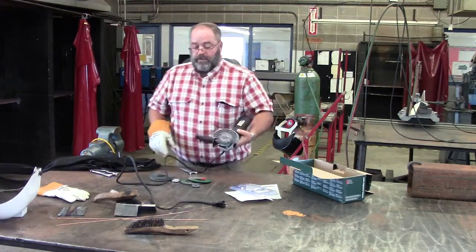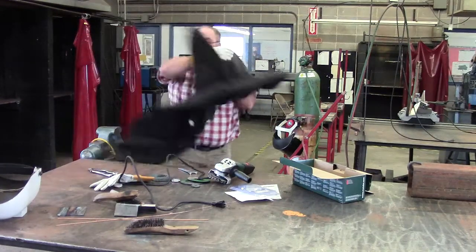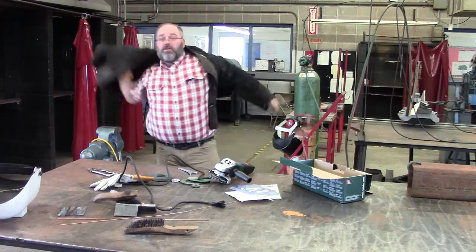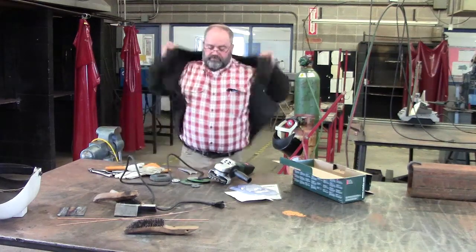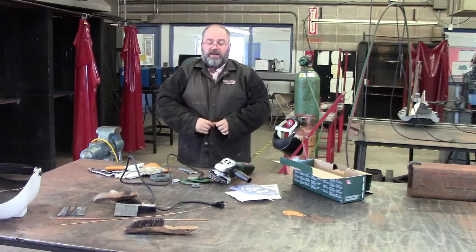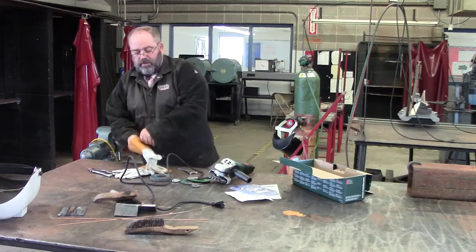Okay? So anytime you get ready to use a grinder, you need to have at least your long sleeve shirt on. I would rather you wear your welding jacket. Button the front of it up so you don't get it caught in it. Wear your gloves.